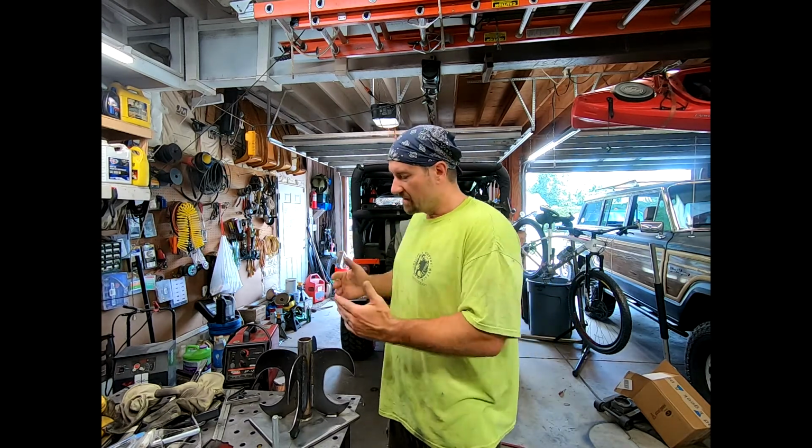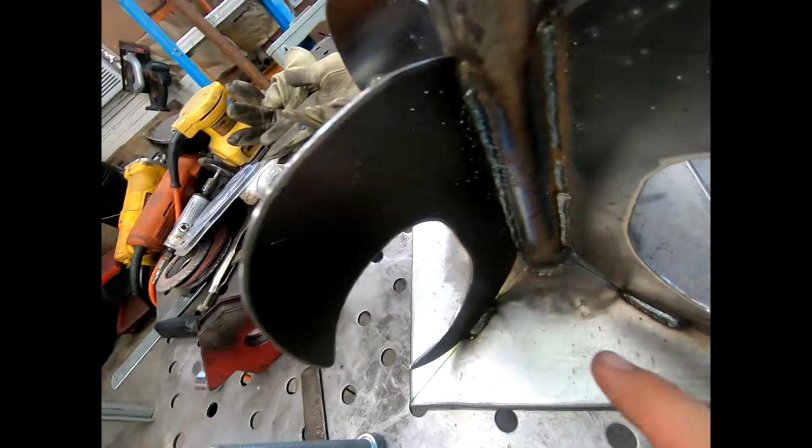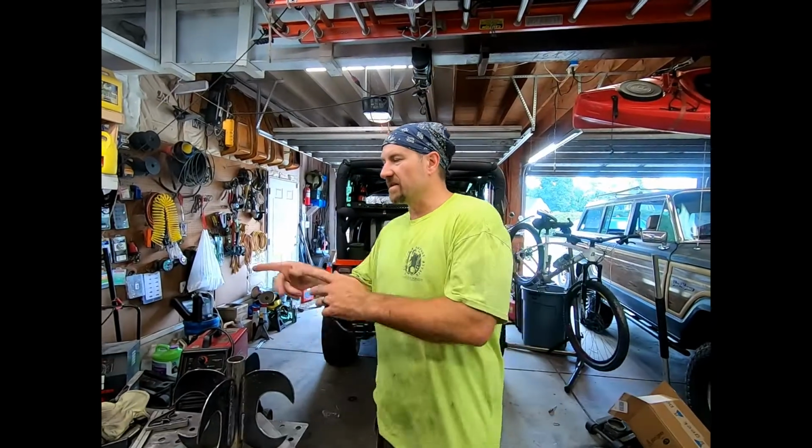with a MIG welder, it does give a lot of slag. So I'm going to have to grind down all the little bubbles. Here, take a look. So you've got all these little bubbles. There you go. Ooh, that's warm. All these little bubbles and stuff like that, that needs to go. So I'll just take the flap wheel, knock those out, takes about a second to do.